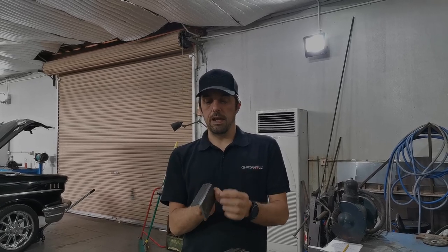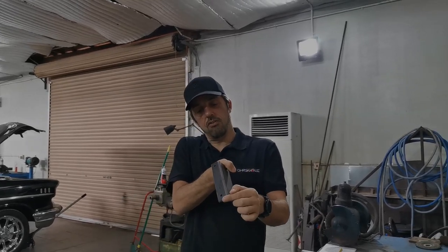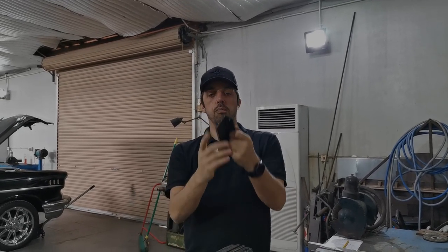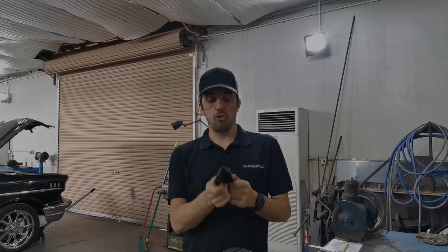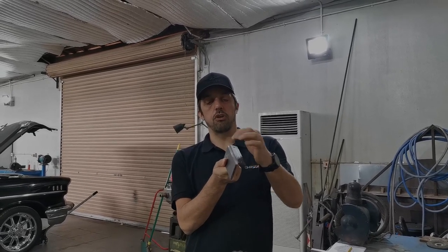So what I've done, I've started, this was flat steel plate. I've actually cut a groove down there with a 1mm cutting disc. So I've cut down into the plate about 3/4 of the way through, and then we just pop it in a vise and knock it over. That way we get a really nice defined right angle bend. I just wouldn't be able to do that with the tools I've got in this shop without doing it this way.